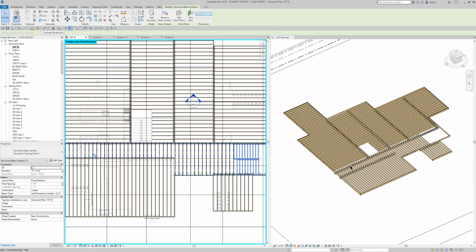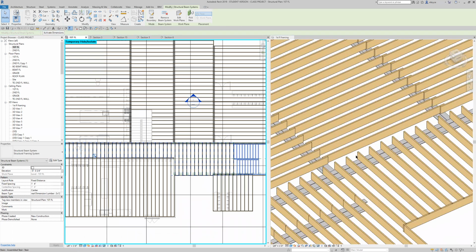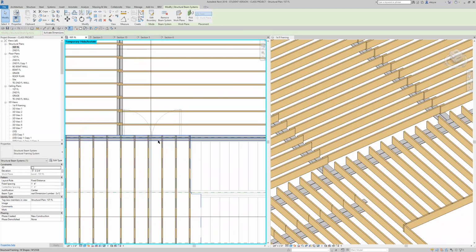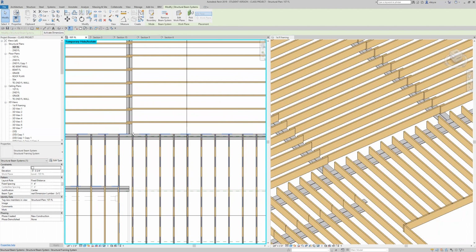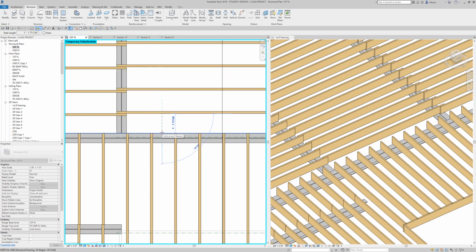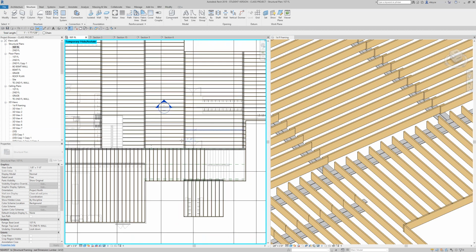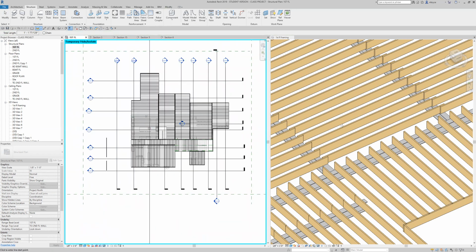Look at my framing. I have two sets of stairs. I have one set of stairs here, and I have another set of stairs here. Now, what's going on right there? Why is my framing? Yeah, I should have another, or maybe not. Let's measure the distance right here. What is the distance from here to here? 13 inches. All right, I guess it's okay. I saw this gap here, but the span is less than 16 inches. So the plywood will just span across there quite comfortably, I think, unless the carpenters want to do it a different way. But anyway, here we go.